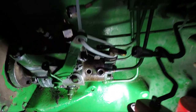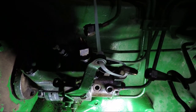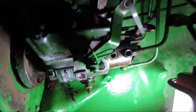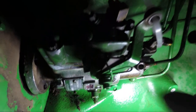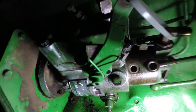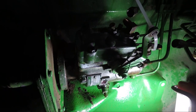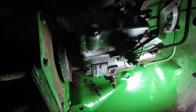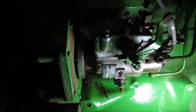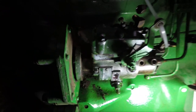Now we're back. I did tie the throttle back — I used a wire tie, put it through the throttle lever, tied it back, and as you can see this throttle lever is pulled back tight past the wide-open position against the governor screw. So it will prevent the governor weights from coming out of their weight retainer and falling down in the pump, which lets the injection technician know we know what we're doing when we take the pump off.